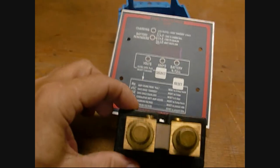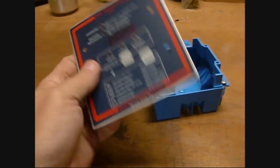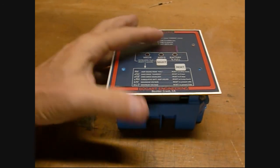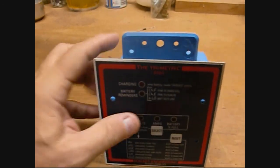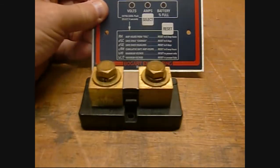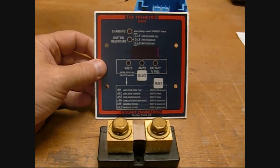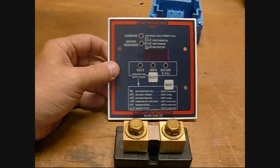Here's my tri-metric that has its shunt. It's just a faceplate piece that came with this plastic box that we normally mount separately. On my diagram I actually thought I would mount it separately, but I'm now thinking I could probably put that right on the front of the box and have that shunt inside. So that leaves one less set of wires coming outside of the gray box. That's the current plan on those.